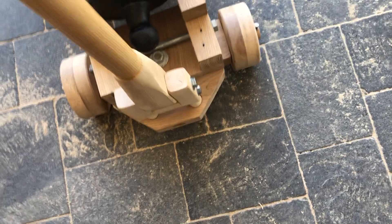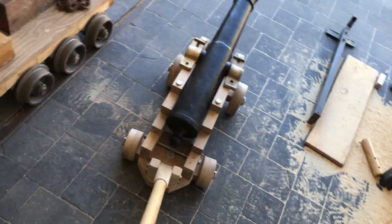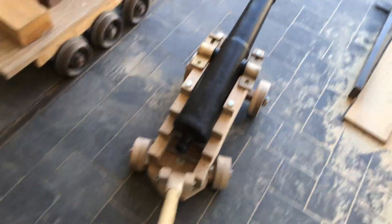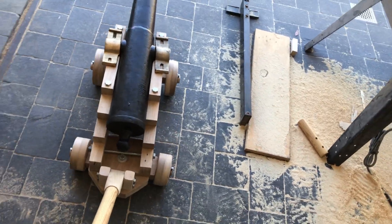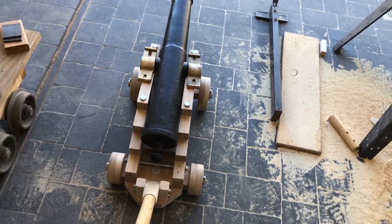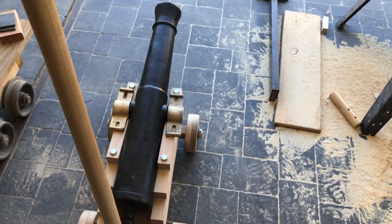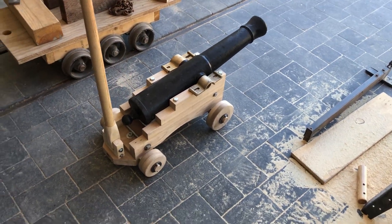We can just push down and then I can pull it around. It works really well. I don't have to worry about it coming out because I machined it to about 15 thousandths tolerance — enough that wetness shouldn't bother it, but tight enough that it is wedged when you pull it.